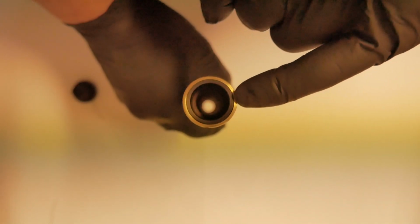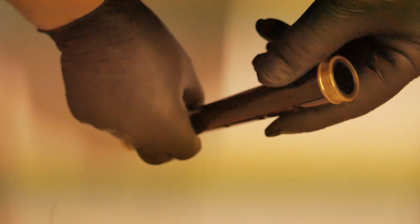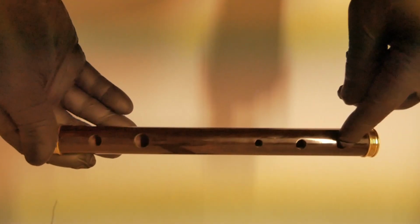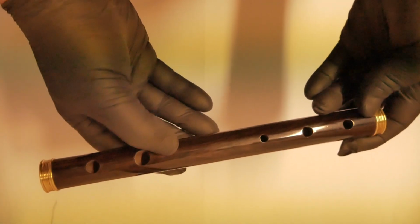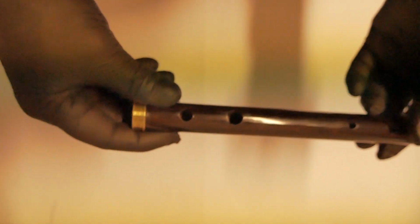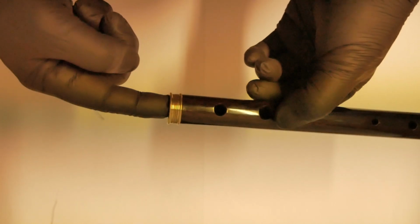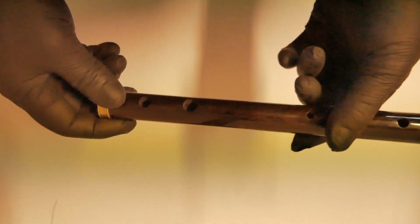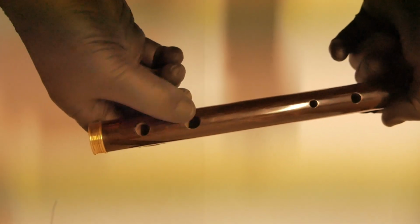Now, if you do look down this bore, it's not very well centered. And the second thing is it's not even straight. It's a banana shape, which suggests that they've used the wrong drill bit, probably a spiral drill bit. It's all right until about here, quite straight, and then it veers off to the right. So in order to try and correct that, they bored from this end, probably recentered it, bored from this end, but weren't able to actually remove the overcutting.